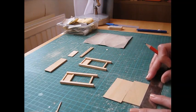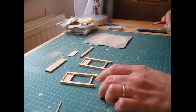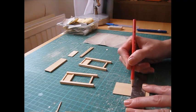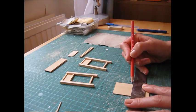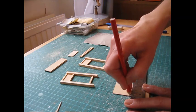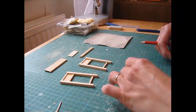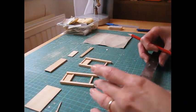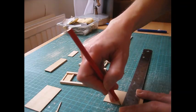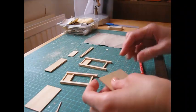This is to help with the placement of the drawer divide so it goes exactly in the center. Join those up and on the top and bottom pieces continue the line onto the front edge of each piece - when they're in place you can easily see that the drawer divide is in the correct position. Join those up and then mark onto the front and back edge of the piece as well.